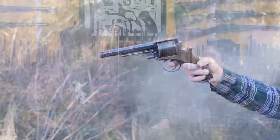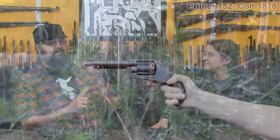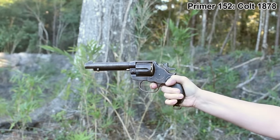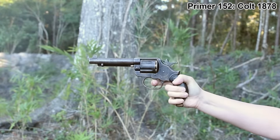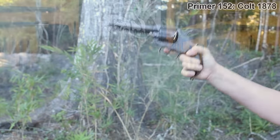This is interesting because the Colt has kind of a worse trigger in terms of weight. It does have a worse trigger, but you can at least reduce that a little bit if you back out that front screw on the front strap. So you have a worse trigger, you have a more complicated mechanism that is liable to break down, but overall the gun has better polish and fit and finish. It's also a much more standardized production, so your parts interchangeability is higher than on the Adams. Less hand-fitting. Yes. However, the Adams is lighter triggered, lighter hammered, and you performed pretty well with the Adams.